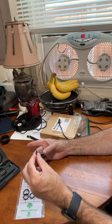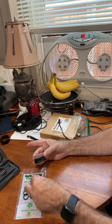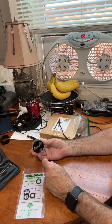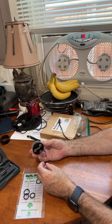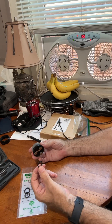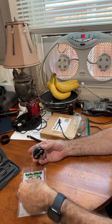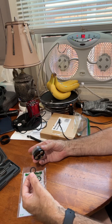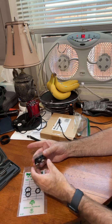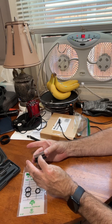The rubber gasket I had on there was very flat. It had been squished down to the point where it wasn't elastic enough to make the collimation possible. I marked this screw with a black dot where it would not adjust anymore and I went to my local hardware store and bought some new rubber O-rings. I took the old one with me and measured it against several new ones, and decided to buy several of them just to make sure I got the right size and thickness.